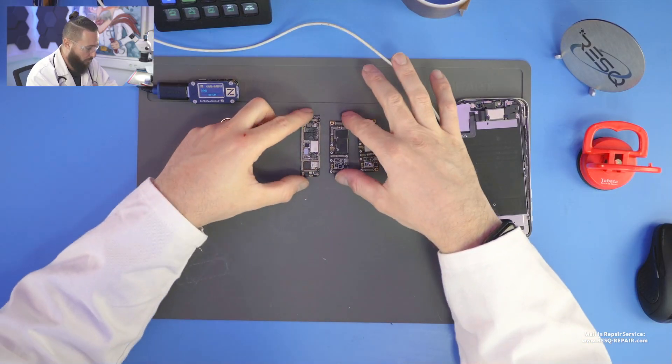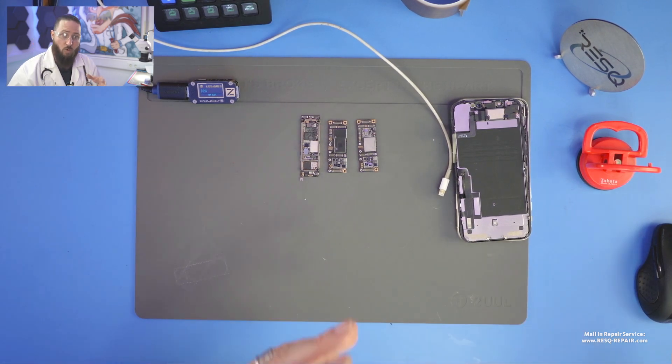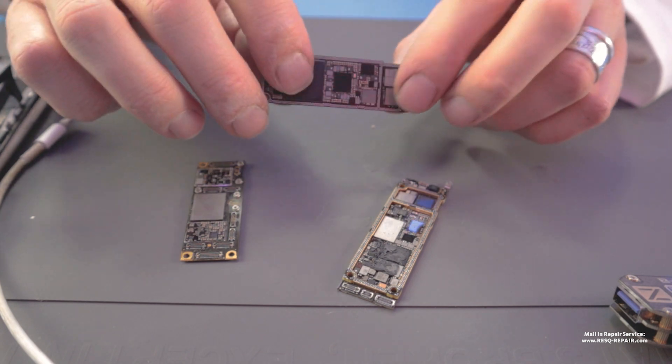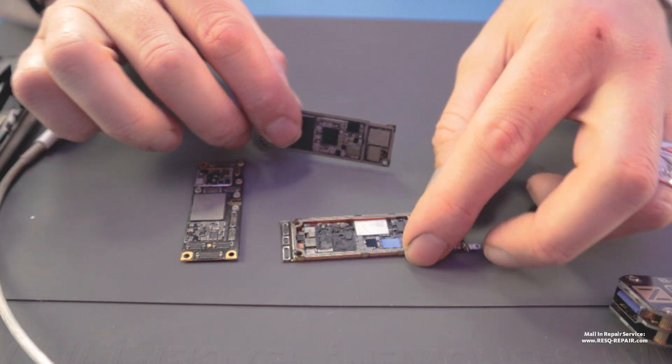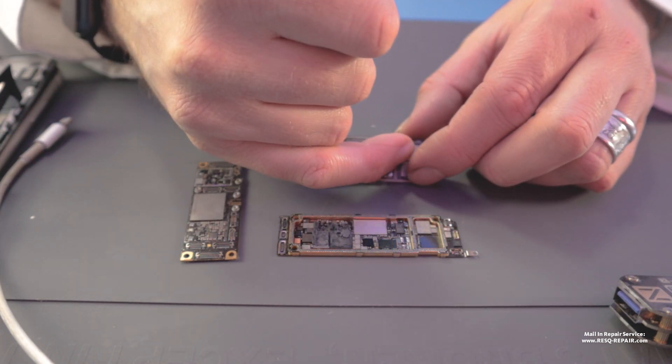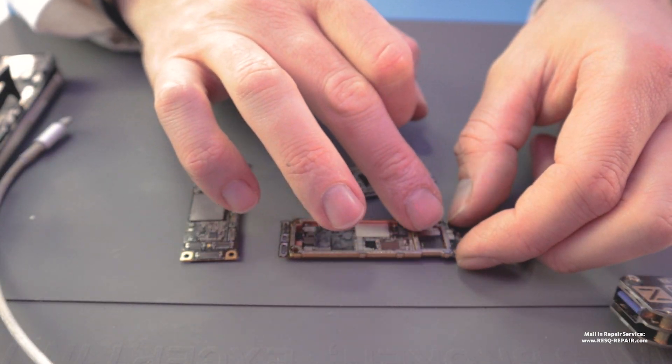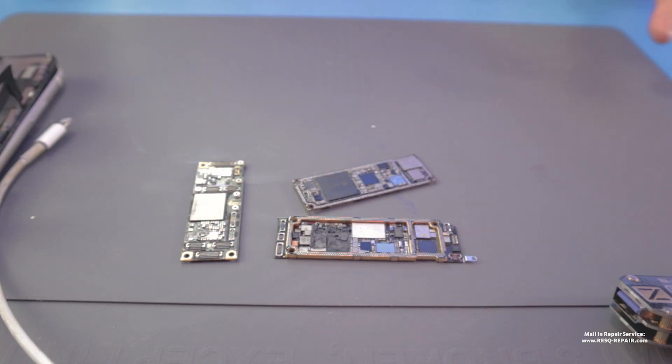I separated the board. Why do I separate the board? If I work only on the backlight circuit, we have a sandwich board, and if I use heat on the top layer it spreads to the middle too. You can cause cold solder joints between the board halves and you can overheat the board. So I always separate the boards and then work directly at the circuit.